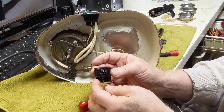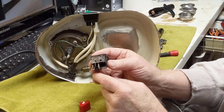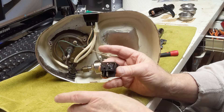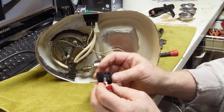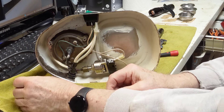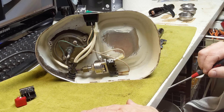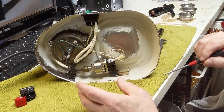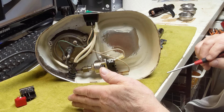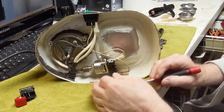The power's coming in here — the hot and neutral — and goes to the hot and neutral coming out. What's nice about these old red and green switches is they switch both the neutral and the positive. In European electronics it doesn't matter as much because the ground is reversible, but in American electronics it's very important that you keep your hot switched and your neutral unswitched.